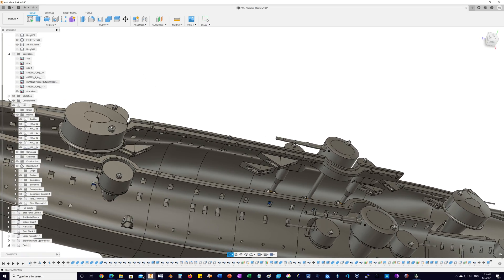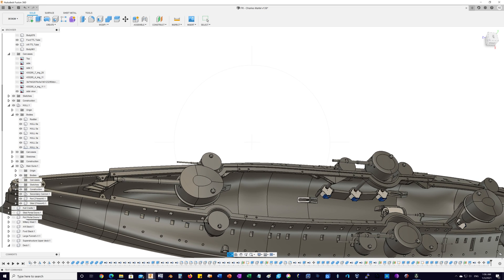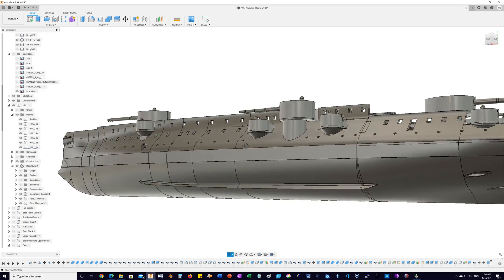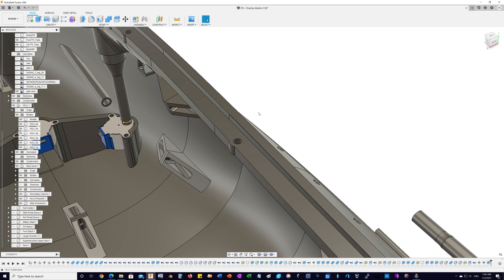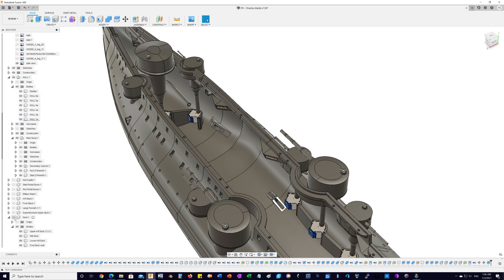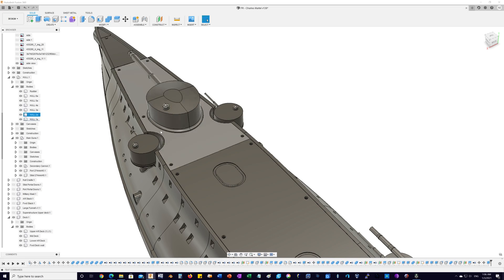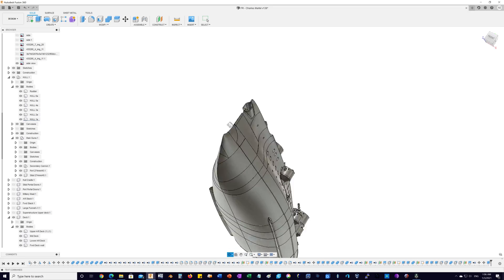On the top rail that sits underneath the deck, I've got a lot of little holes. These are for heat inserts — basically a copper threaded insert that you melt in using a soldering iron with a tapered or straight tip. Once that's done, you can take a machine screw and screw down into those inserts to lock the deck down pretty securely.